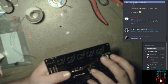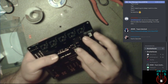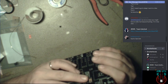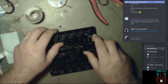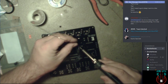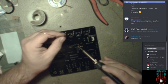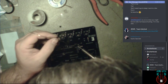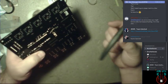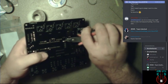Okay. So this is specifically made for running at 1 megahertz. This is what this 4 PWM code is tuned for. But that's fine. That's what you'd want to run that thing at anyway. If you're running it any higher, then you probably shouldn't be using an ATtiny85 for it. There are other better options than an ATtiny, unless you're just absolutely constrained to that package. Even then, there are better chips in that package. Maybe for cost, maybe, but even then.